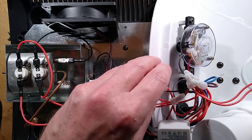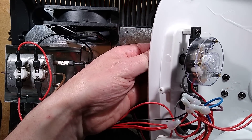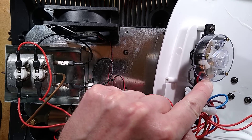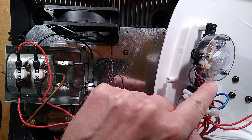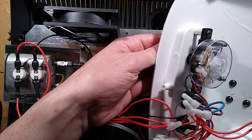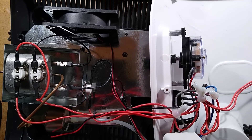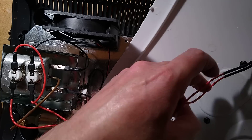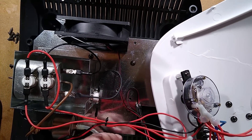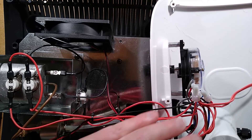The escapement mechanism in here is quite interesting. This is the little timer and it's got those contacts. If I twist this you'll see the contacts close, and then that little escapement weight will rattle backwards and forwards, allowing the pawl to go round until it gets to the end — then it goes off with a sharp click, opening the contacts decisively and jamming that little rocking weight to stop it wobbling and making noises. There are a couple of wires going out to an indicator, and in reality it's only being used as an indicator light.